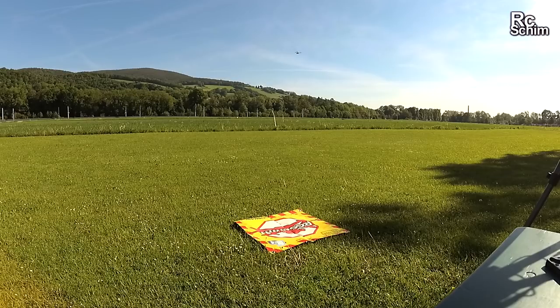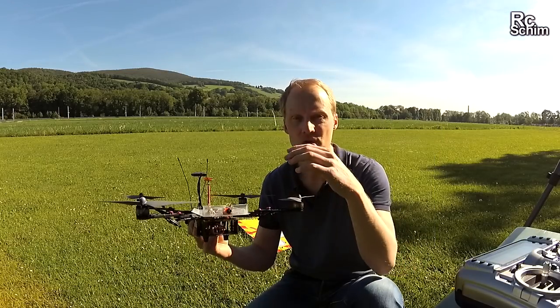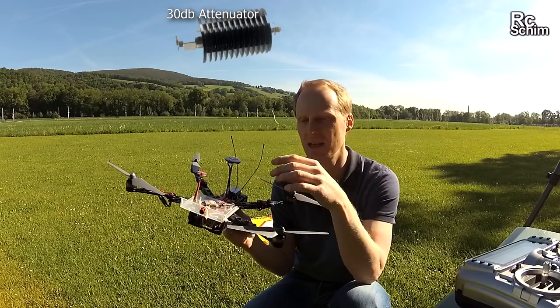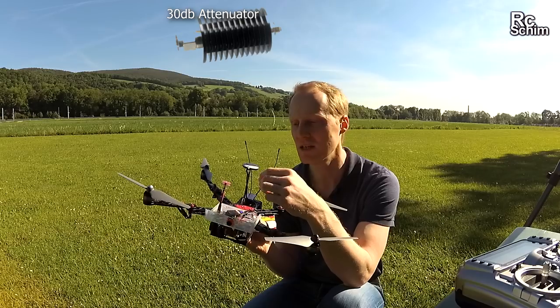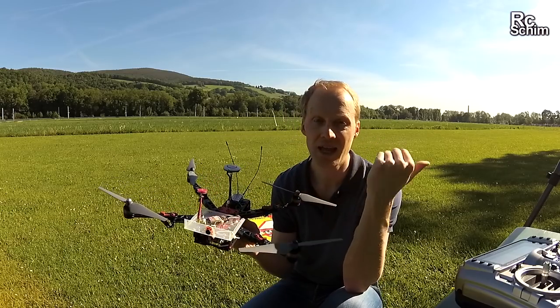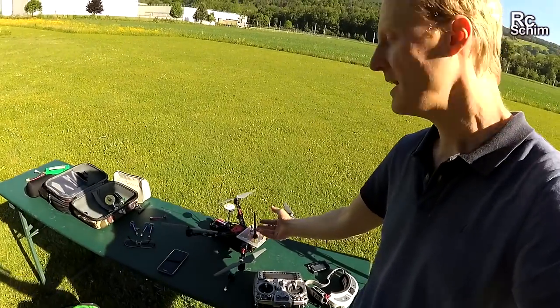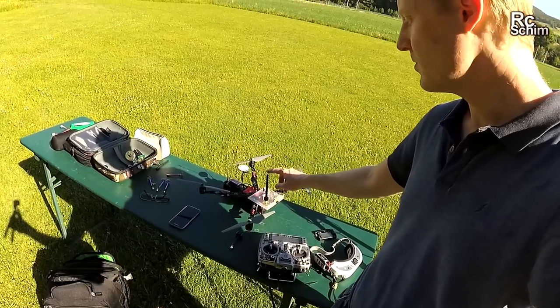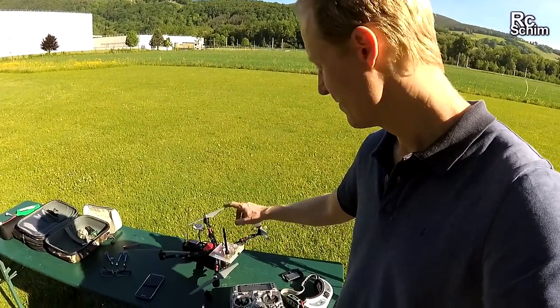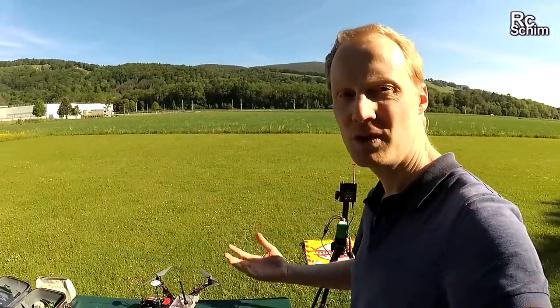Okay I tested all of them. Now switching to using the attenuator. What an attenuator does is act like an electrical resistor - you reduce the signal going out to the antenna. I will do this on the transmitting side to see the gain of the receiving antenna. It's a 30dB attenuator, so there will not be much signal coming out of the antenna. I'll use the linear polarized antenna and send a reduced signal from about 50 meters, then switch receiving antennas. This makes it faster for me.